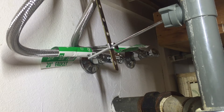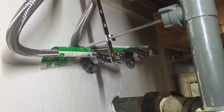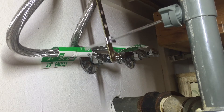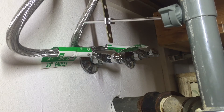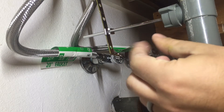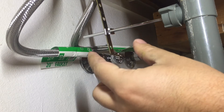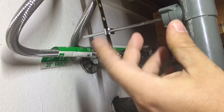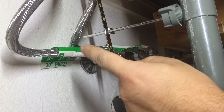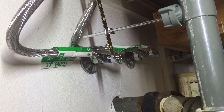I'm going to pull on the lift rod from the top of the sink — and that's exactly what we want to see. Do this a couple of times to make sure the spring clamp doesn't start falling off again. More than likely, the spring clip will just need to be widened again over time, as it can get smaller or might break. This is usually the culprit when your drain stopper is not working.